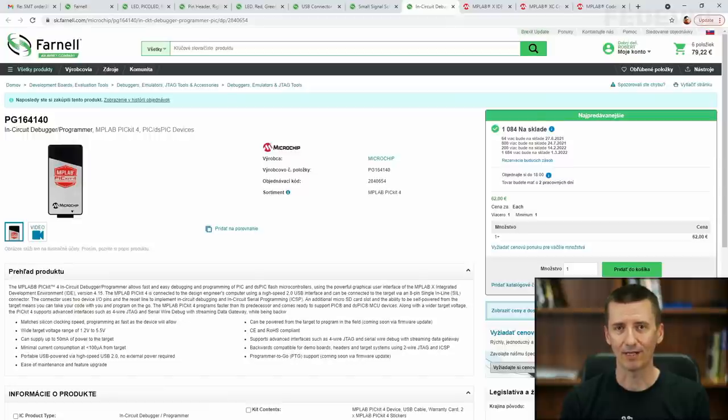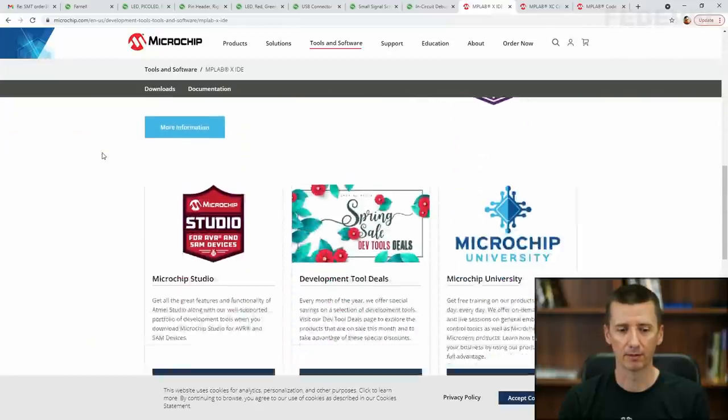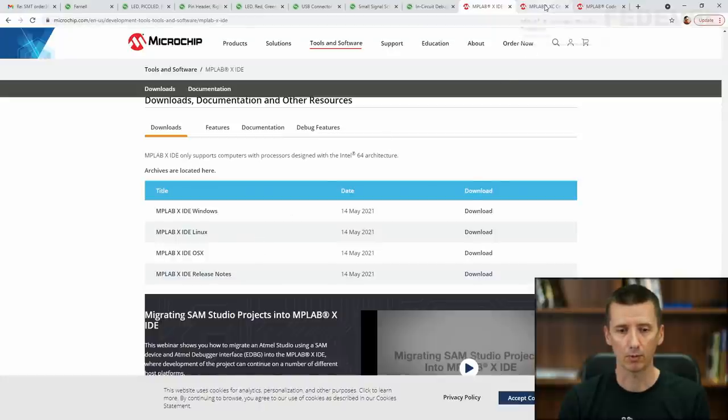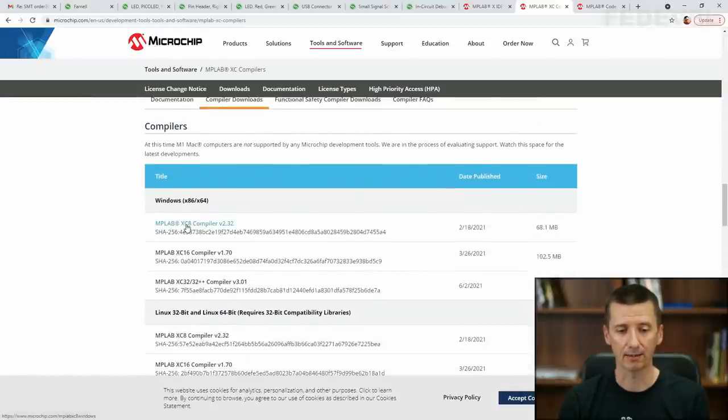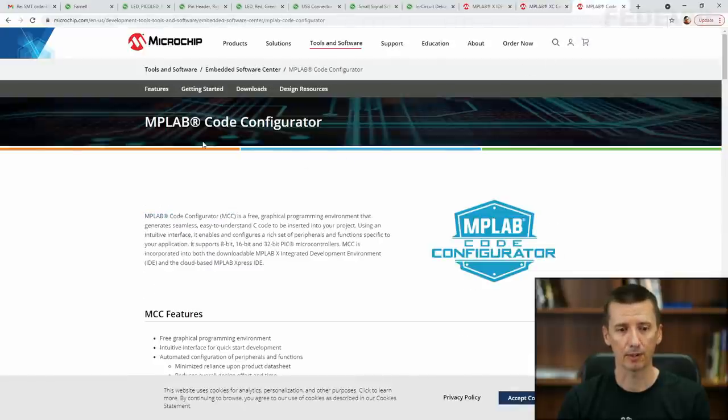If you would like to start with the software even before you receive your board, you can do it because you can use a simulator. What you will need is to install this MPLAB software. You can download it down here. You will also need this MPLAB XC compiler. To be specific, you will need this XC8 compiler. And also, once you install MPLAB, enable this code configurator. It can help you a lot to write this software. It can save a lot of time. But all this I will explain in the next videos when we will be learning how to write this software. I only wanted to mention this in case you would like to start with the software before you actually receive your boards.